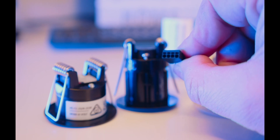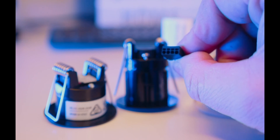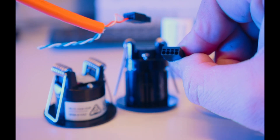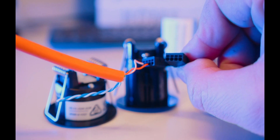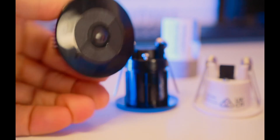If you're on site you can get these all wired up into the ceiling, let the painter and decorator do their thing, then come back afterwards and push the PIRs up into a fresh, clean ceiling that won't get dusty or marked. Once all done and dusted, it's just a case of pushing the connector back into the unit and popping it up into the ceiling.